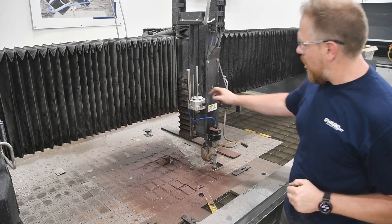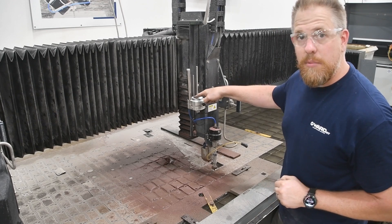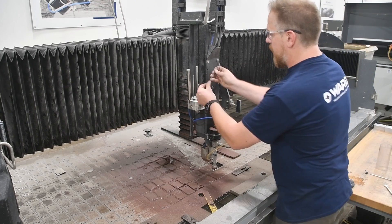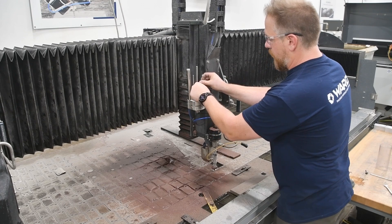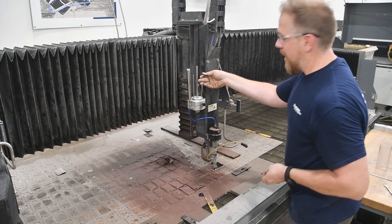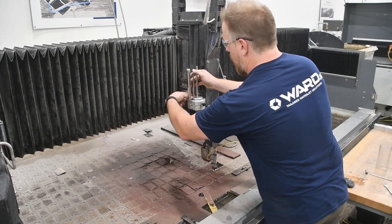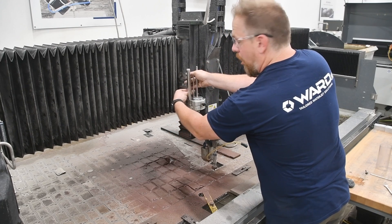Important things to know when you clean this off: check to see if you had some debris covering these holes. That's kind of important. If you did, it's in your best interest to re-weigh your abrasive. You may have had a partial block for a while and didn't know it, and may have been weighing abrasive with that partial block.